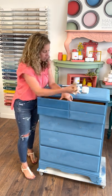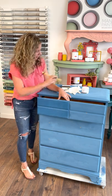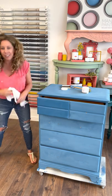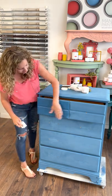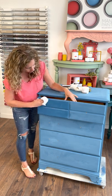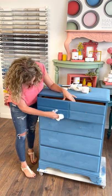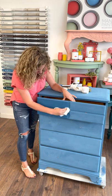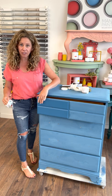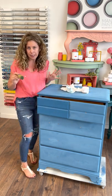I'll get a little bit more on my brush. You can see it's basically covered this whole half drawer already in a matter of seconds. I have t-shirt rags here. I'm going to take a t-shirt rag now and I'm just going to wipe off any excess — really I'm just kind of smoothing it out, making sure that wax has got on every little angle. As I'm rubbing it, it's taking off any excess wax, so it doesn't really feel waxy now to the touch.